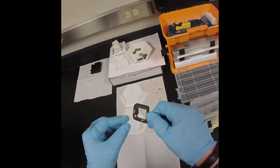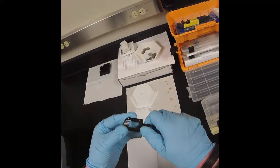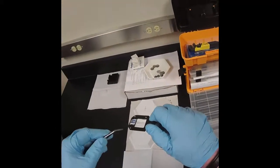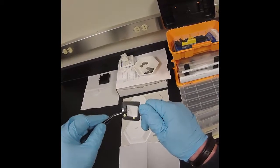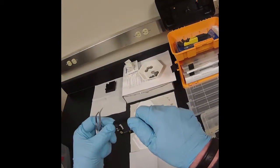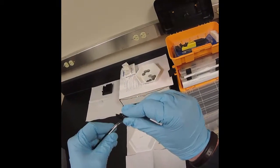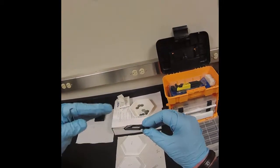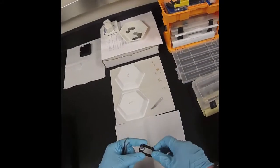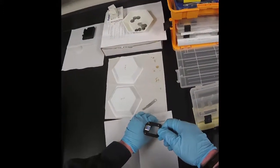So this is the cartridge for using tapping mode, and how do I know that? You can see here, if you look carefully, there's a tan plastic wafer. That is a small piezoelectric crystal that a voltage is going to be applied to, which will cause the probe tip to vibrate, and therefore tap the surface.